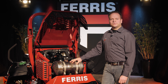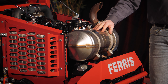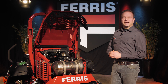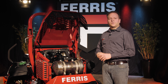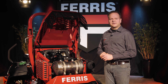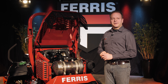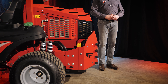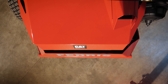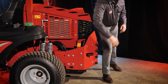At the rear of the engine, we find an after-treatment system that keeps engine emissions below the permissible range. This diesel oxidation catalyst is a flow-through catalyst principle, which forces the exhaust fumes through an internal honeycomb catalyst housed within a stainless steel container. The exhaust gases from the engine pass the catalyst where a chemical reaction takes place to oxidize carbon monoxide, hydrocarbon, and a soluble organic fraction of particulate matter.